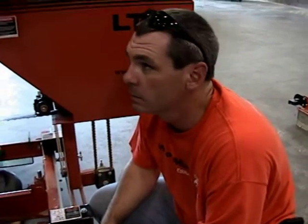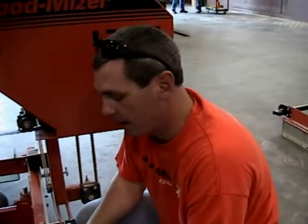Yeah. A quarter of a millimeter there is. And that's the way they're designed, because when we bought those rollers, they wanted the rollers to be softer than the material they're rolling on, because that bar is welded to the mill. It's more difficult to replace that bar. I missed that. We discussed that during the morning seminar. Exactly. Yeah. Okay. So the tough steel. That's right. His mill is 10 years old, and these kind of things come up. You know. It's good for training.